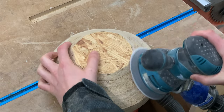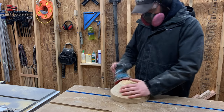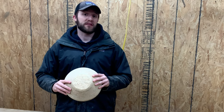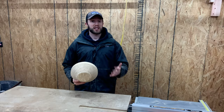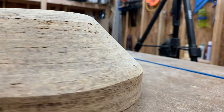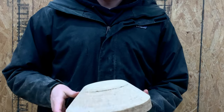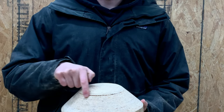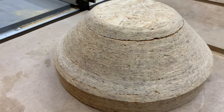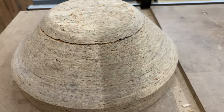That flat shape of the bevel made it super easy to sand — I pretty much just rotated the bowl around and it was pretty much perfect. We just got the sanding done on the outside and honestly everything looks pretty good; I was able to get it pretty nice and smooth. Not as great as a lathe would, but it still looks pretty good. One issue that cropped up is I started to see a couple small cracks between each layer of the glue-up, so if you're going to try this at home, instead of using wood glue, try using epoxy or something that's going to fill all those voids and really hold all the pieces together.